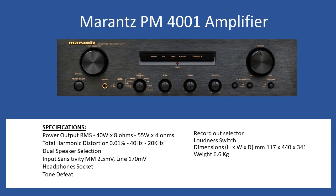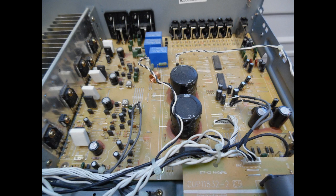When the amplifier came into the workshop, the noted fault was no indication of power-up. With the top cover removed, the first thing that strikes you is the amount of dust layering the entire circuit board. This was simply removed with a long bristle brush and a small amount of compressed air. It hadn't been in a damp environment, so the dust wasn't stuck to the board — no greasiness or stickiness — easy enough to do.